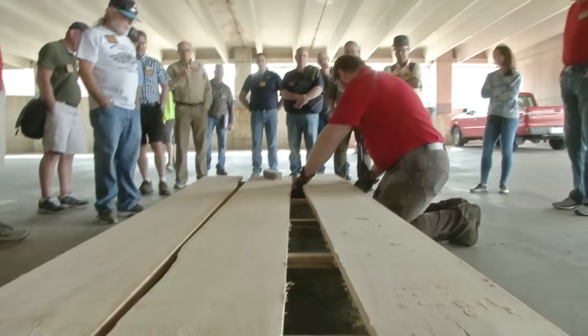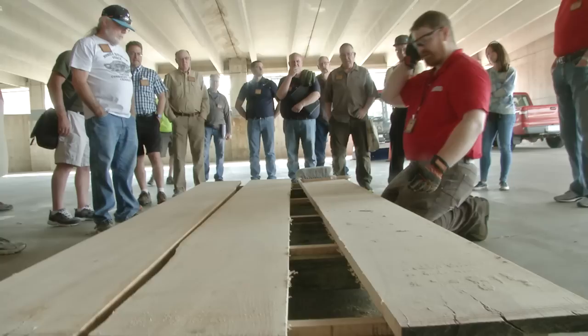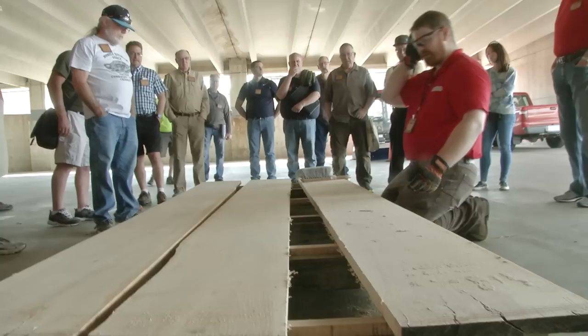You can see this stuff wiggles around until you get some weight on it. What I'd want to do next is get this cleaned off — you really don't want sawdust where your sticker hits. Try to get these stickers perfectly spaced, get the next layer on without disturbing it, and just work my way up. And then you wait. It's like a savings account — you just wait.